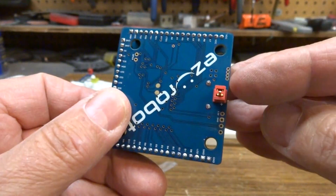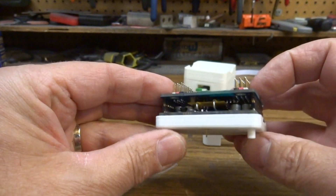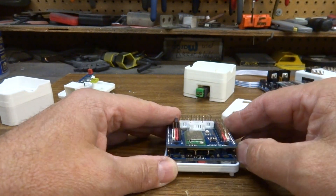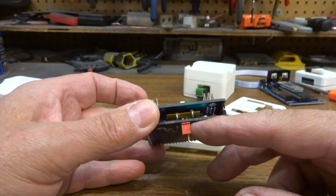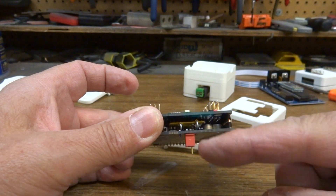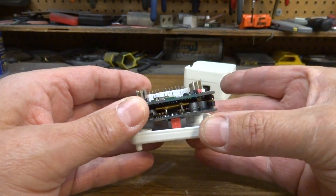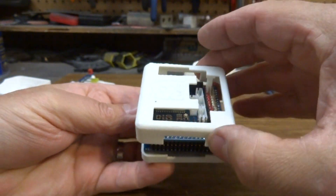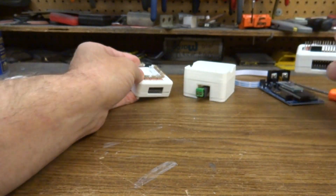Headers all the way around, and there's a little power plug. A guy could leave that all together as a nice little stand, set it down and run it like that. But you can see the power is coming out the bottom, and that's not going to work for me. So what I'm going to have to do in my B9 robot that I'm building is these are going to mount flat. I've already got to retrofit these — I'm going to have to take this off and mount it a different way or just run wires straight out like a pigtail and put a Molex connector on it.